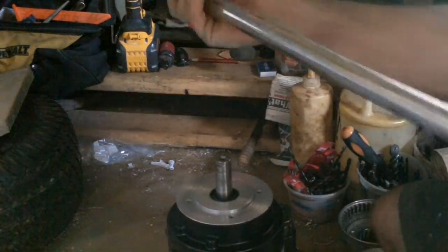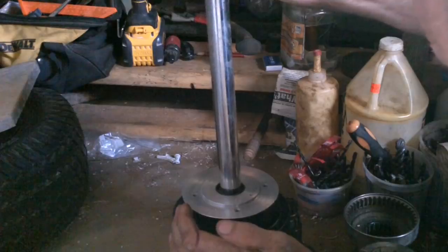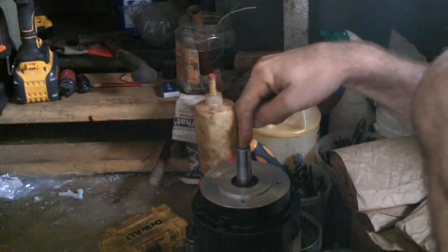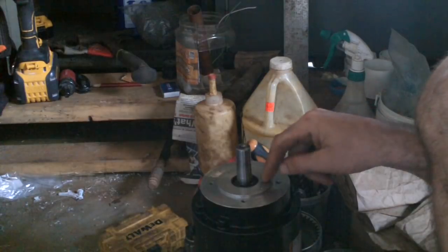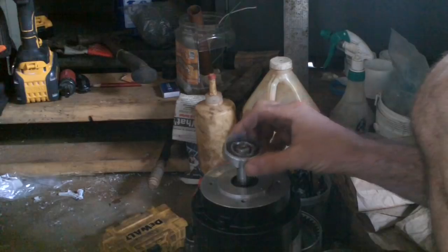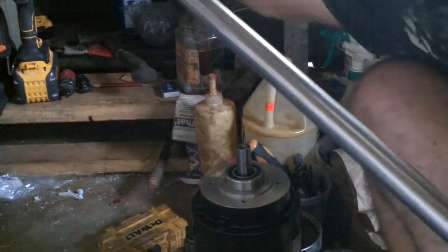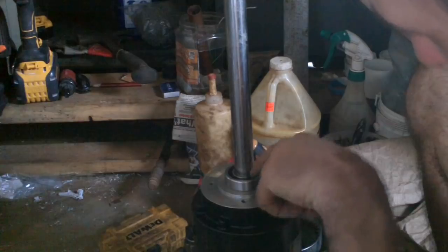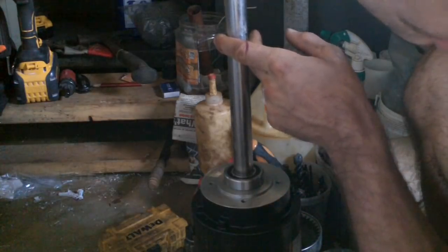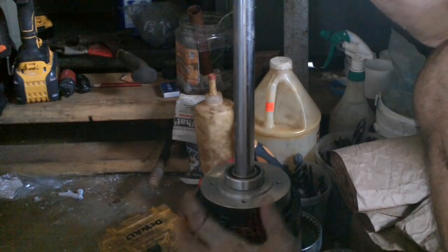Here's the end of my motor. Let's see how this tube fits on there - I'll just have to make a thin sleeve in there. Good thing I have a lathe now. This is going to have a fair amount of force pushing that way, because when the propeller shaft is on there the propellers are at that end, and all the force is going into this. I don't want to just rely on the bearings in the motor to take all that. So I'm thinking I'll put a bearing here, just resting the outside ring right against the housing. Then I can take my propeller shaft tube, put it there, and put something on here that will rest against the bearing. So when the propeller shaft is trying to push down, it will push against this bearing which will push into the housing, and the housing will be able to handle lots of force right there.